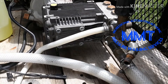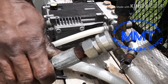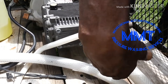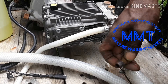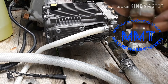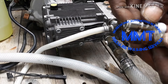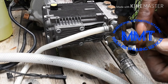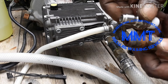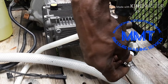Okay guys, this is the fitting we're gonna change on the pressure washer. We've already got a stainless fitting on our whip line, but this right here is starting to leak — it's already loose. We're gonna take it loose and let you guys check it out. It's already got a little pitting on it. If you look real carefully right there, you can see where the little balls were — that actually causes leaks. So we're upgrading this fitting.